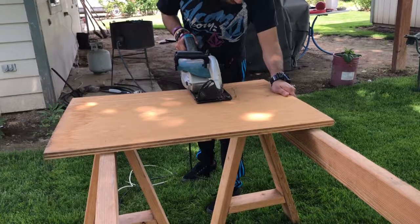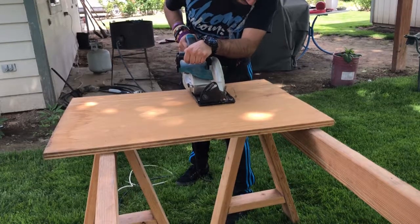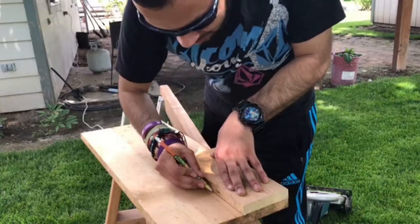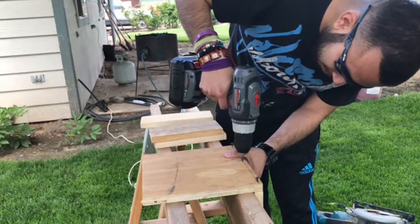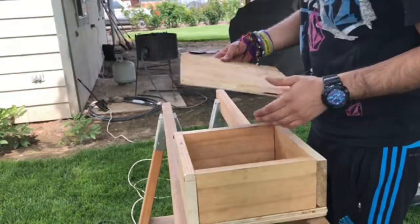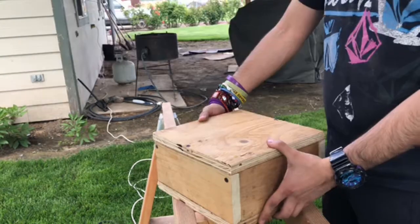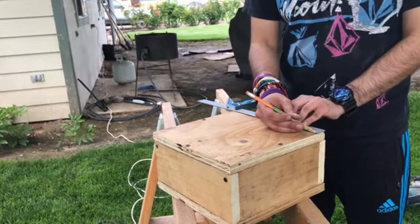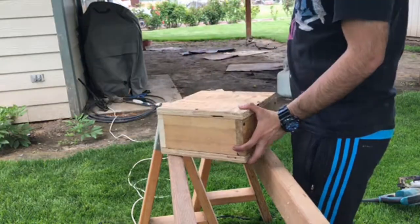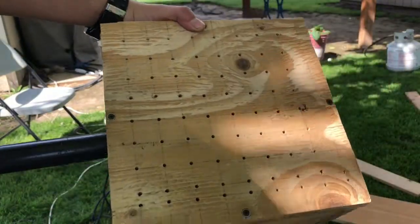With a max dimension of 9.5 inches for the top mold, I decided to create a 10 by 10 vacuum form. To create the vacuum former, I simply cut out two sheets of plywood with a circular saw. Once these pieces were cut, I then cut out four pieces of solid 2x4s, which I then screwed onto one of the plates. To ensure a secure seal, I generously applied wood glue onto the internal corners and proceeded to screw the top plate onto the box. The next step involved drilling holes into an evenly set grid, which was drawn out by a ruler and pencil. A drill and jigsaw was then used to cut out the vacuum hole on the side of the box.